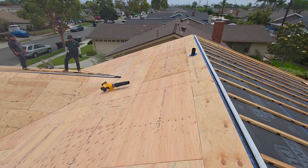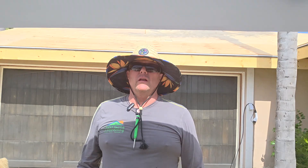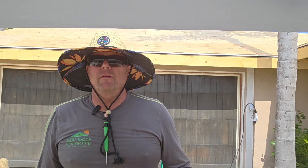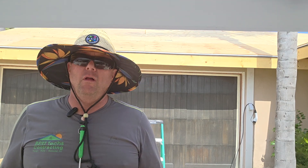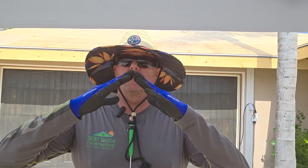Just got done getting all the plywood on top of the roof. Now we have a vented roof deck but an unvented conditioned attic, and that's our goal on any home that we build. First off it's fire resiliency; second off it provides better comfort for the homeowner by relocating that insulation to your roof rafters.